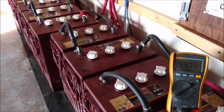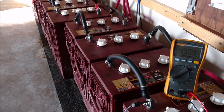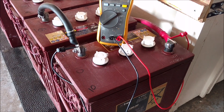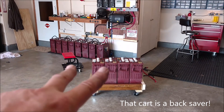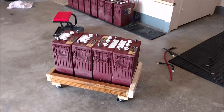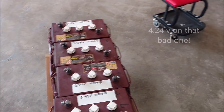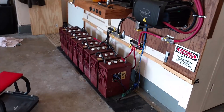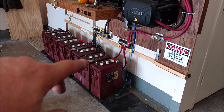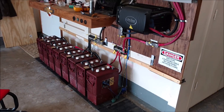I disconnected everything, cleaned every battery post, every lug, and took the good batteries in that string three and moved them over to string two. Fired everything back up, down to a two-string battery bank. I took the good ones, put them into that string, took some measurements, and taped them. I have three L16 backup batteries here. I essentially rewired everything, cleaned every terminal, redid one cable end, and got everything hooked back up and ready to fire it back up.